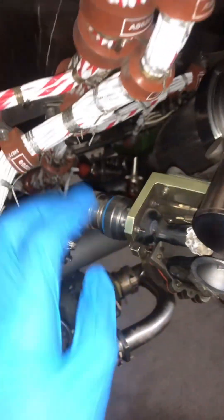Now let's look at the system as a whole. That's the pneumatic starter valve — it controls the flow of air going to the pneumatic starter. That's the starter valve solenoid and the wiring that goes to the EEC to control the starter valve. Let's go down the ducts to the pneumatic starter, the one that does the main job itself, and the accessory gearbox that turns the engine through the HP shaft.